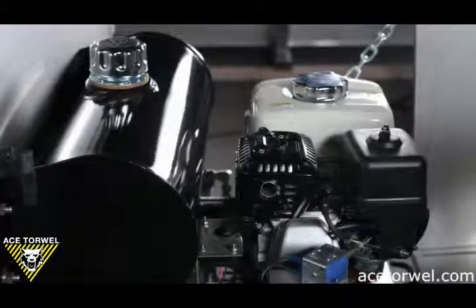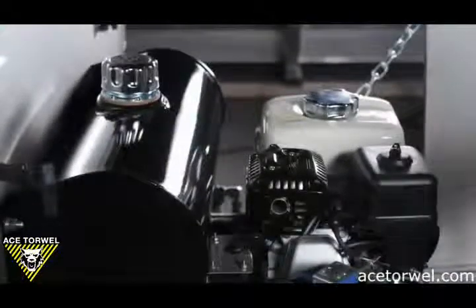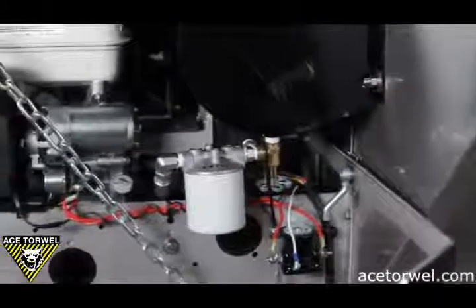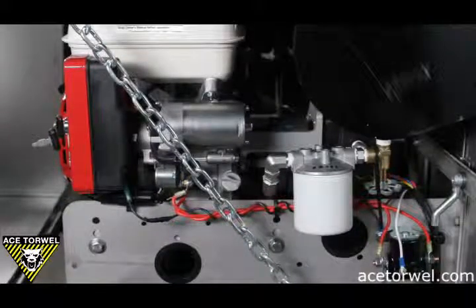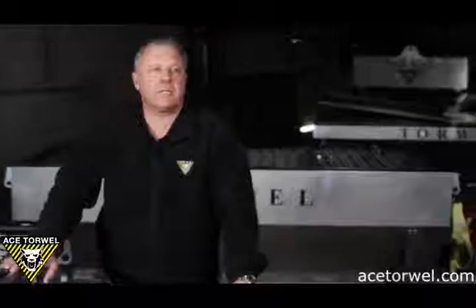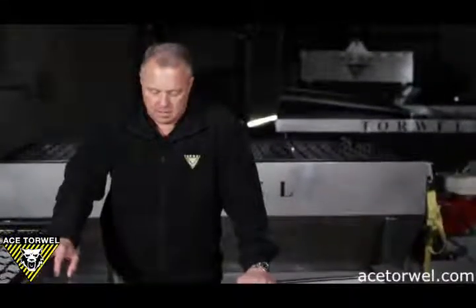One additional feature on the hydraulic system is the frozen or stuck load relief pressure valve. A pump is installed to the horizontal shaft, which in turn goes into a solenoid block. The block controls the flow of oil through the conveyor motor to the spinner motor and then back to the tank. A pressure relief valve in the block means that if something becomes lodged in the conveyor, the unit sends the oil to tank rather than trying to spin the conveyor shaft. The unit should then be shut down and whatever is clogged in the conveyor should be removed.